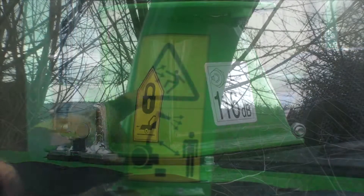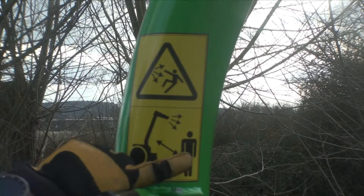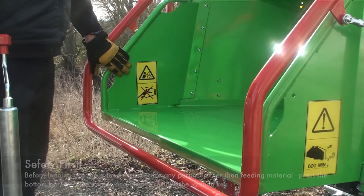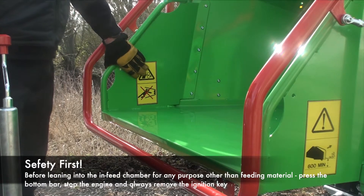Because of wood chips coming out of the discharge chute, always make sure that people are aware of the direction of flow and never walk in front of it while the machine is chipping. This decal refers to being inside a wood chipper — never reach inside a wood chipper while it's operating. Those infeed rollers will pull you in if you get anywhere near them, so never go in there.